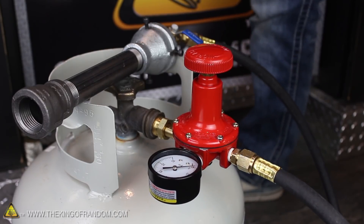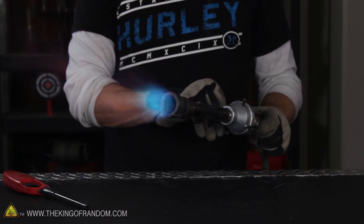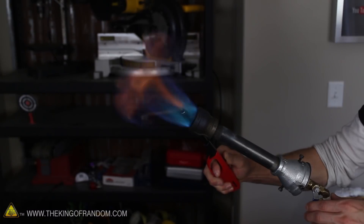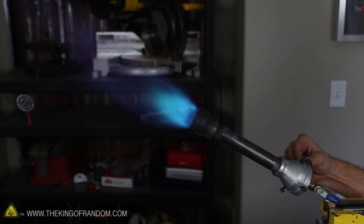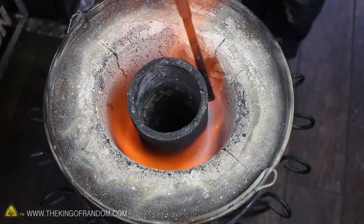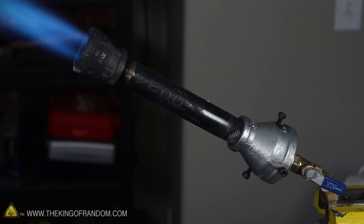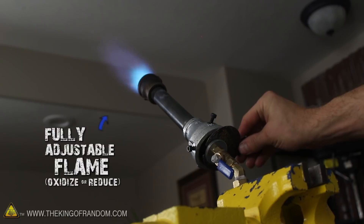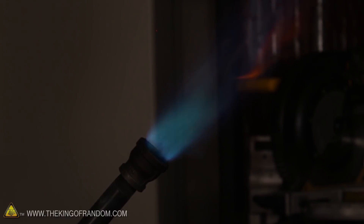At this point our propane torch is 100% finished, so let's take it for a test drive. Firing up the torch really couldn't be easier — simply hold a flame near the nozzle with one hand and slowly open the valve on the torch with the other. If we slowly adjust the air regulator at the back, we can convert it from a fire belching blow torch to a metal melting jet torch in just an instant. The sound and color of the flame will tell you a lot about how the fuel and the air are balanced. If you're planning to melt metal, just play with the flame until you get a nice blue color and a jet loud roar. Blue flames are slightly oxidizing and are the color I use for my backyard casting. By regulating the air intake, you have the option of using any length of pipe you want and can slide between an oxidizing flame and a reducing flame as quick as you need.